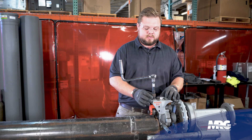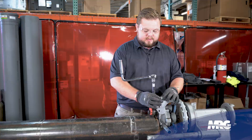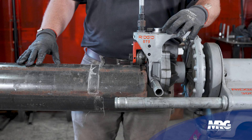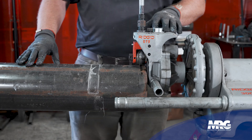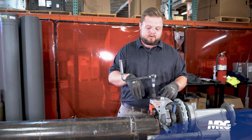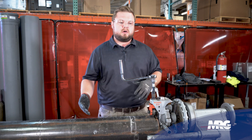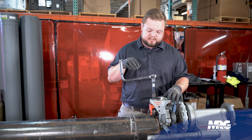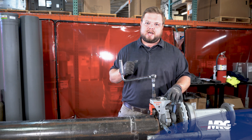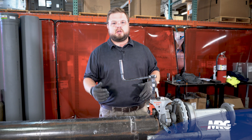Once that is firmly tight, I back off my adjusting nut a quarter-inch turn and then rotate this step gauge all the way back to zero. What that allows me to do is, as this pipe is getting grooved down, this adjusting screw goes down with it — and once you know that you're complete, this adjusting screw will actually set flush and be extremely tight. So don't over-tighten; once you feel a good tug and you can't move it anymore, that's it — you're good to go.